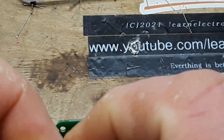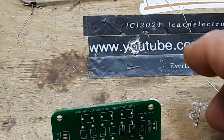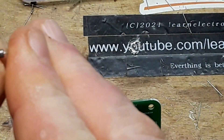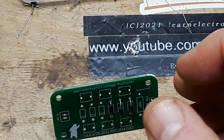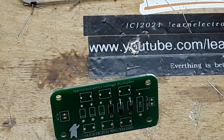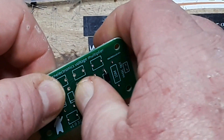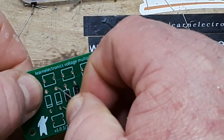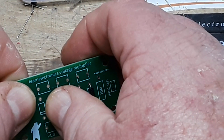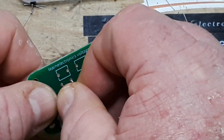I'm just bending the leads by hand — as long as you have the right size footprints they should drop in pretty easily. Any high-voltage silicon diode will work fine, and any flavor of high-voltage capacitor — just keep your capacitance low so we're not dealing with a massive buildup of energy. Notice I didn't say voltage, because the way this circuit works each section is basically just going to double the input, so each section is only going to have about 300 volts on it.